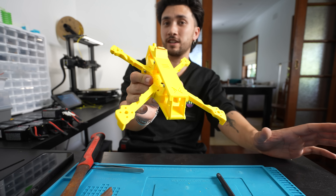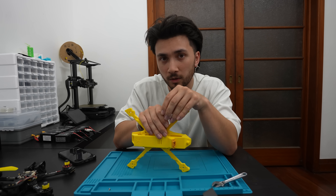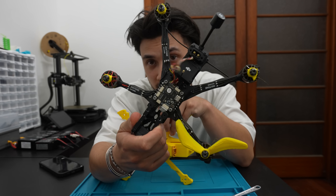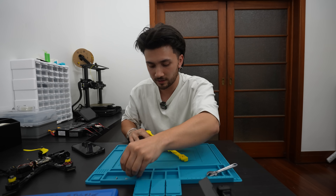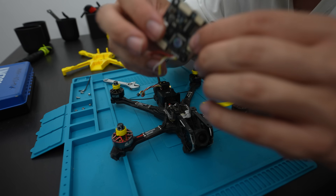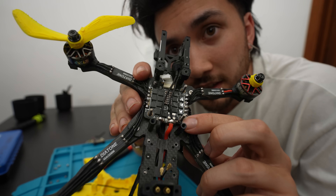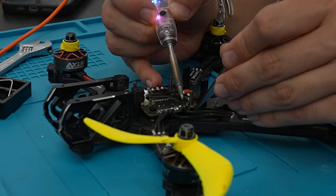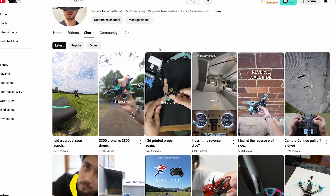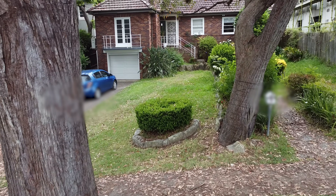The frame design is pretty much ready, as long as the electronics fit. We removed all components from the old drone and transferred them to the new frame piece by piece — the flight controller, VTX, camera, and ESC. The ESC required desoldering each point one by one. Worth noting: the old drone had 3D printed propellers that I tested in a YouTube short, but they had so little lift the drone crashed, so we're not using them here — the focus is purely on the frame.